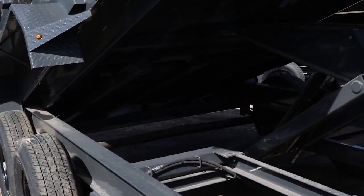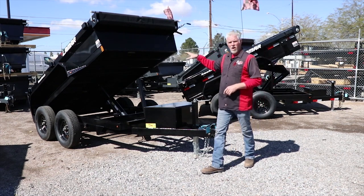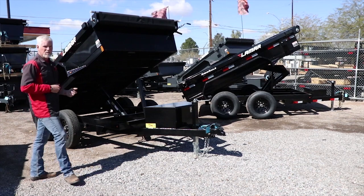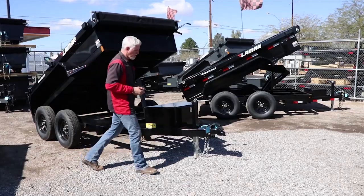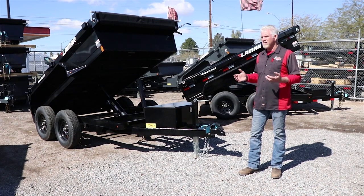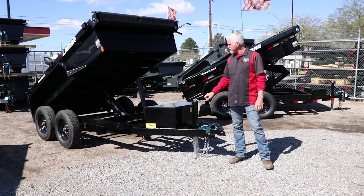When you're looking for a dump trailer you've got to decide on volume and weight. Mini dumps are typically five by ten with an eighteen-inch side rail, though you can get a two-foot side rail. You can also get side extension kits that go on the side walls to increase the volume of the trailer — those are nice options to have on any dump trailer if you find yourself doing demolition work or loading a lot of lighter materials rather than sand, gravel, or concrete.